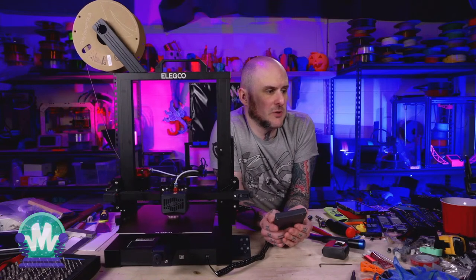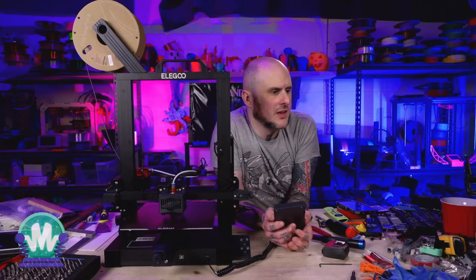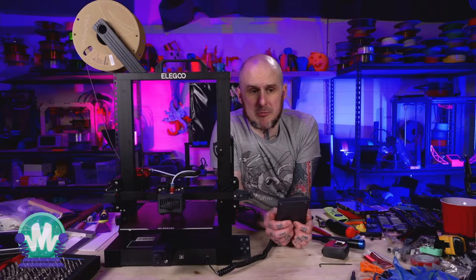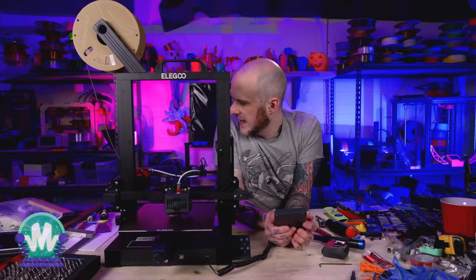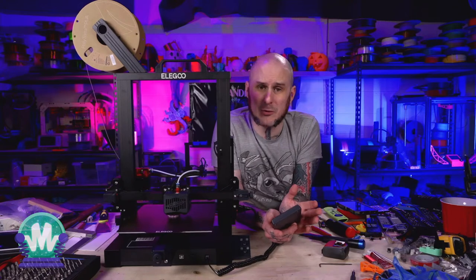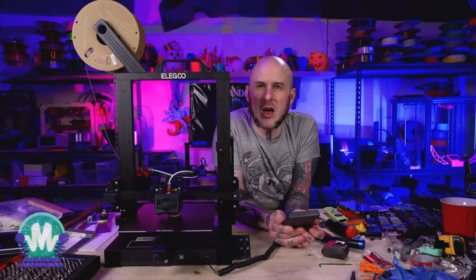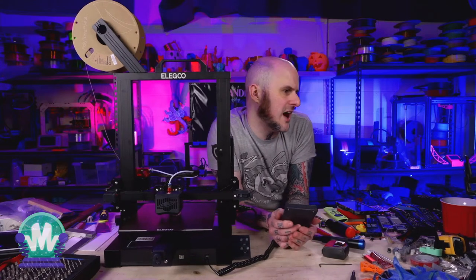With Klipper and input shaping, I'm pushing 120. Cool. I was printing on my Ender... I put Klipper on my original Ender 3 yesterday for the first time and printed out a pretty not that great, but all right, Benchy at 150 on infill, 100 on external perimeter, and 125 on internal perimeter.